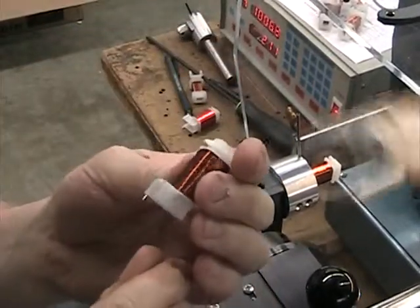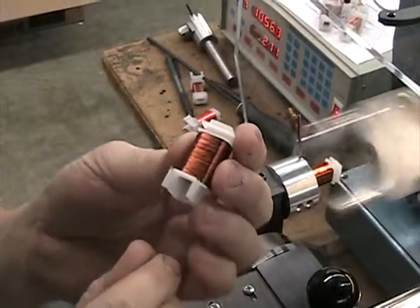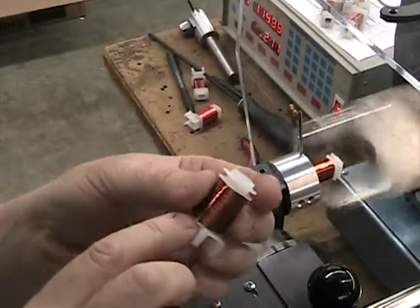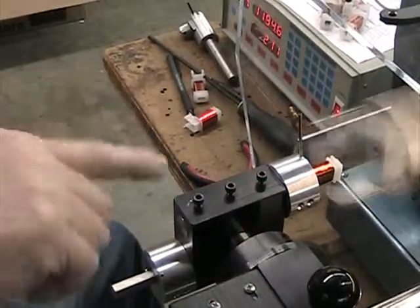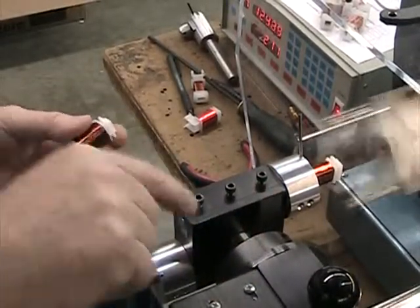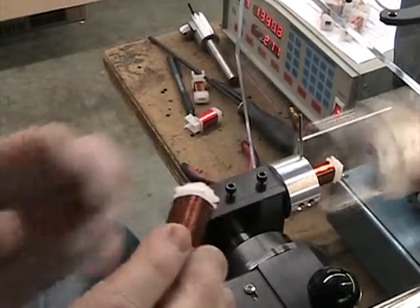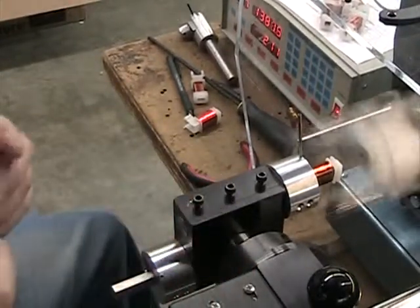This is only the first attempt and it looks pretty good. The only thing I did wrong: it's a mirror image of the sample that was sent to me — the start lead was not on this side, it was on the other side. All we'd have to do is rotate the tooling 180 degrees and put the roll pin on the opposite side. That's the only issue — it's a mirror image of the coil that was sent. And that's pretty much it.